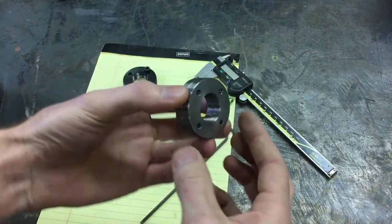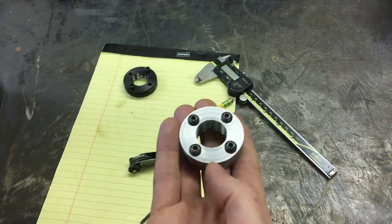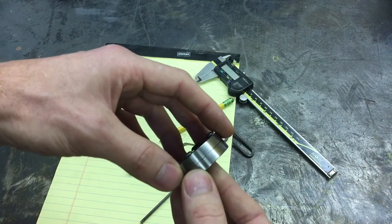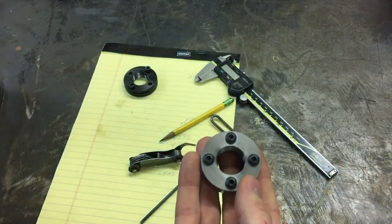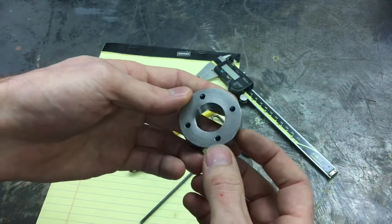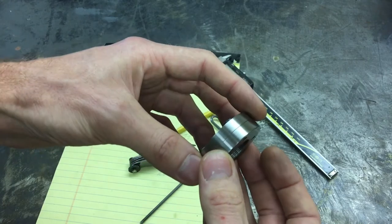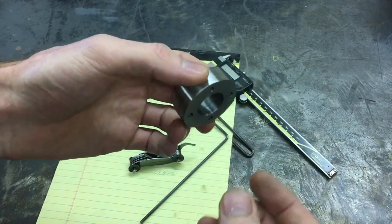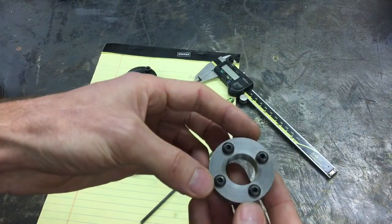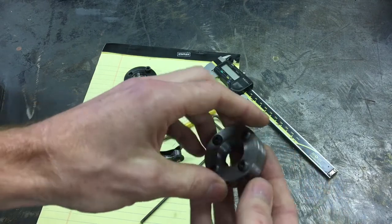This was made from 4140 or stress-proof — some sort of shafting — done on a lathe, bored and single-pointed. Single-pointed threads on this kind of thing are important for concentricity reasons. Someone might be tempted to use a tap, but for rotating assemblies, single-pointing is the only way to do it. A slug was single-pointed, a spud was made in the lathe and single-pointed, threaded onto that, then all the OD machine work was done, plus four through-holes for Number 10 cap screws.